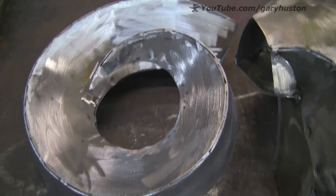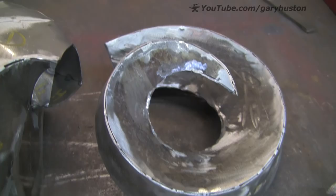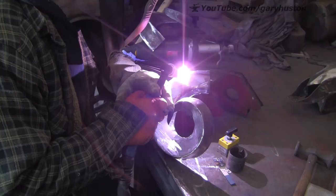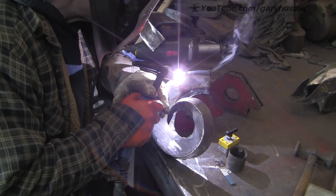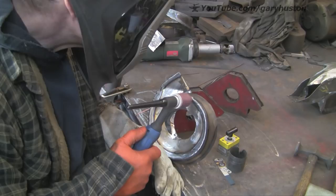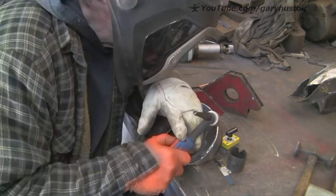So there we are, we're all ready to weld. I think I mentioned it in the last video — I'm going to TIG this one up, whereas the horse's head I actually MIGged up. And although the MIG is much quicker and much easier, I think the TIG is going to mean I have a lot easier time on the clean up. So let's give it a go. What I'm trying to do on this is just fuse weld it where I can. Obviously there's going to be a few bits that I need to add some metal to. That's why I wanted to get a really good fit-up — it just makes welding it up much easier.